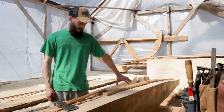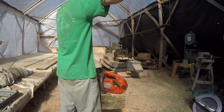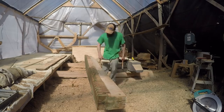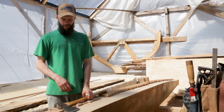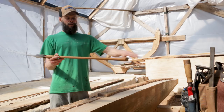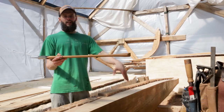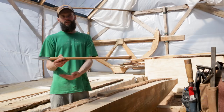Once I got that side piece removed where we had cut with the saw, the next step was to come through with the chainsaw and make a whole bunch of kerfs very carefully. Then I started at the highest point in the keel timber, notched out a couple pieces with the chisel, and went through with the axe and whacked them out. The reason I started at the high point with the chisel is that the grain of this wood runs fairly straight and then we curved it. So as I'm chiseling out from the center, the grain is still running parallel with that high spot. The chances of me lifting a piece where the grain runs down into where we want good timber is a lot less. If I had started at the end, the grain running parallel there would want to rip off into the timber and I'd have a much bigger chance of tear-out. So in instances like this, it's really important to read the grain.